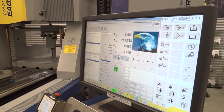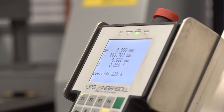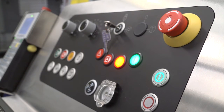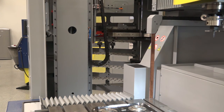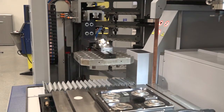It's a very high-end EDM machine — what control drives it? We're using the Andronic control, which we've historically used on the milling side as well, so it makes sense to use both together. It's a very easy system to use: touch screen, with the ability to bring offsets directly into the program, which is a huge cost saving for the operator. Or you can work in a traditional way — probing electrodes and probing work pieces on the machine. For automation, all the programming can be done on the control itself, and the automation is called in as a simple job list, which is the first step into automation.